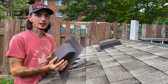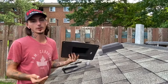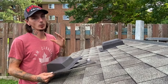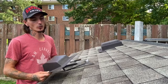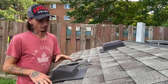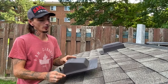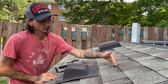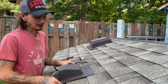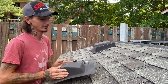When it comes to putting in a kitchen vent, dryer vent, furnace vent, or whatever you want to use this for, it's generally the same concept. The only difference is when you're installing one of these, it's typically lower on the roof than your regular box vent. This one can land almost anywhere on a shingle, so it varies — you can't really just go off the top of the shingle line. This one may land here or it may land here, depending on where it's going to land on your exposure.